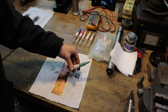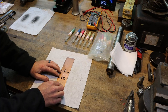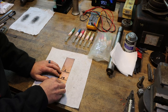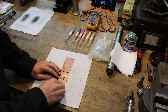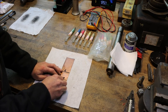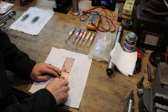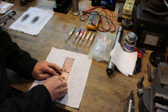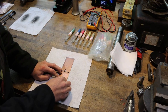So we're starting out pretty rough, 14 micron on the diamond plate. Just put it on there, spread it around, and rub it until you've got the entire surface scuffed up to 14 micron, taking all the hollows out of it and getting it good and flat. You can hear this stuff cutting, the heavier abrasive. It embeds into this piece of copper and sticks around pretty good. So now just rub this until it's good and flat, spinning it around.